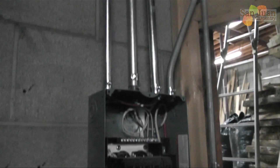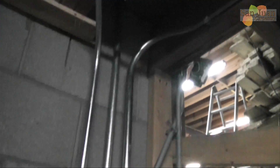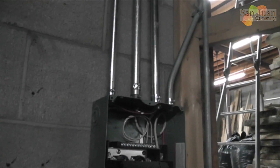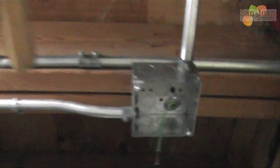This is my new sub panel. The pipe on the left is the pipe I'm working on right now - you can see a little 90 with a kick to get up to the joist. I've got it attached to the joist. Now one thing I have to point out is that I don't have it supported within one foot of the panel, which I should, and I'll probably get around to that at some point. So anyway we're coming along and we hit our first box - this is going to be a receptacle, my charging station.